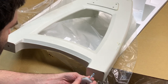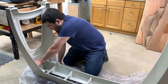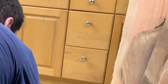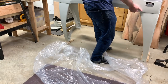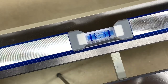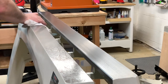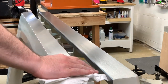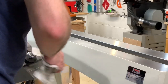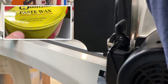The entire assembly was quite easy and didn't take a lot of time. I had no issues other than I was stupidly wearing sandals that I forgot about, but luckily nothing happened. It did take me about 10 minutes to level the lathe out, but that was due to my shop floor. I used some paper towels to clean the bulk of the grease off, but came back later with a degreaser. You can also use mineral spirits, but either way, don't get anything on the paint. I also lubricated all of the parts with a dry spray lubrication and then came back with a couple of coats of paste wax.